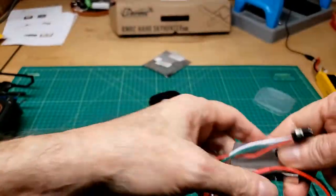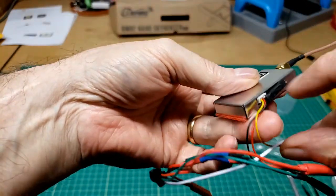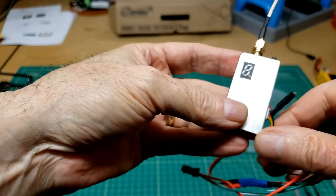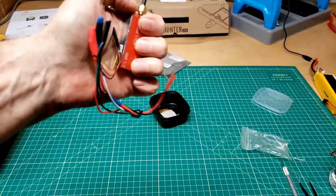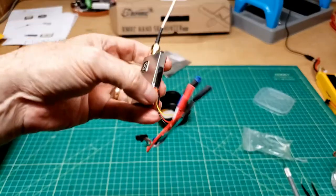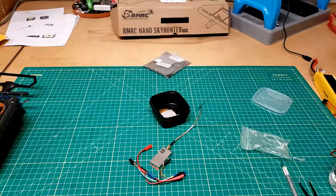I have another ready-made RC video transmitter like that one with exactly the same connector on it. I've had this one for 8 years or more. I think it's exactly the same thing. I don't think there's any change in them in years. So I'm going to hook this into that cable and hook it back to the flight controller and see if this one comes on, as a last desperate attempt to keep from digging that flight controller back out of that fuselage. Luckily, with that sliding equipment tray, it's not really all that big of a deal at all.